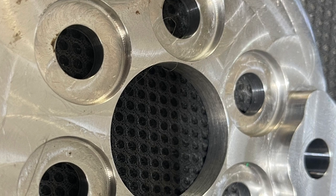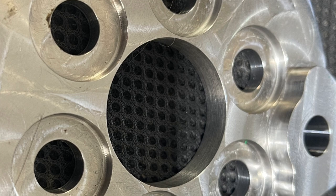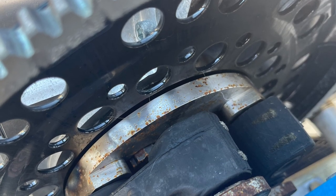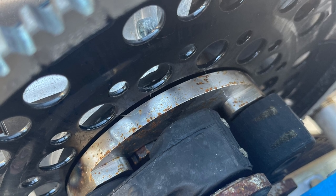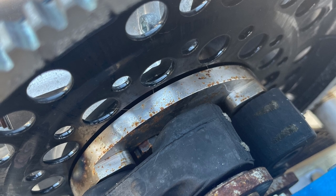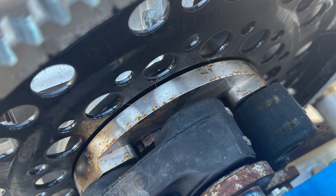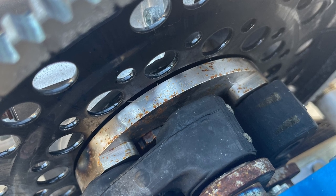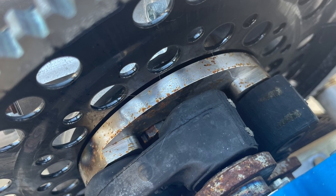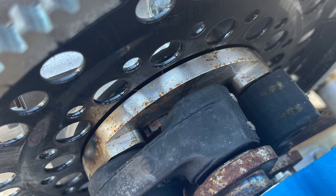Here's a picture of the correct drive coupling on the flywheel with the counterbores showing. This picture shows the correct installation of the drive couplings. There are three of them. They're all rounded on the corners the way that we ship them. It is not a continuous circle, which is not approved. And the engine, which here turns counterclockwise, pulls the gearbox around and does not push it.